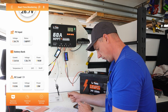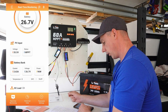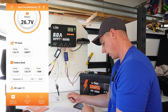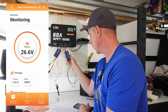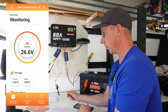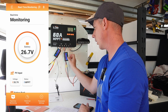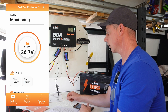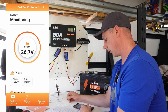Back to our solar production — we're now doing 96 watts out of two 100 watt foldable panels. I'm going to let this run and come back around 12 to 1 o'clock when the sun is highest in the sky. Right now I'm showing 103 watts on the input meter and 96 watts going into the battery — so we're in the 95% efficiency range. Seven watts difference out of roughly 103 watts is about 94 to 95% efficient, which is really good.